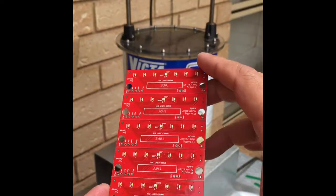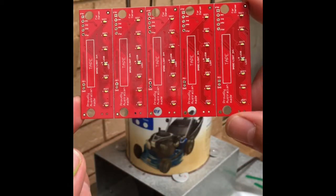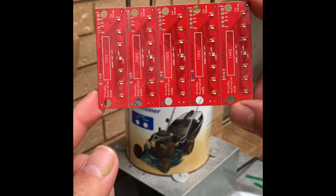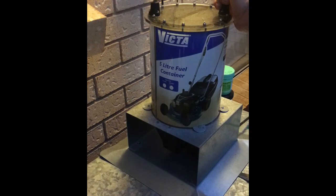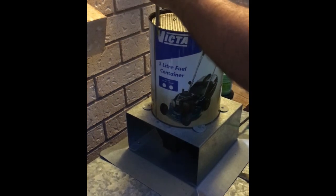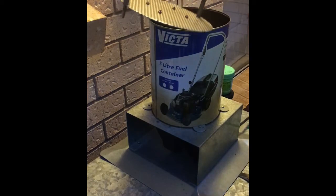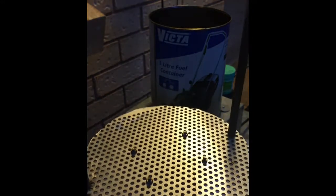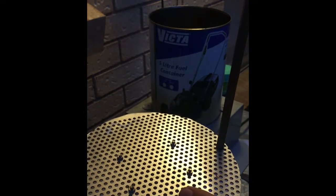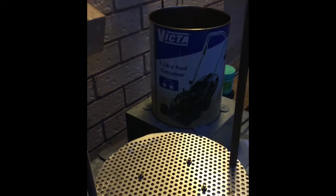Not a single tombstone — not bad for a home-loaded board. Gotta love it. And the one side now with the LEDs — now it's time for the oven. You see these screws I'm putting here — they are my supports because the board has now got components on the bottom and I've just loaded the top; we don't want the components on the bottom to be damaged.